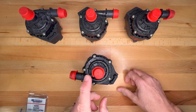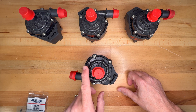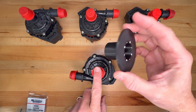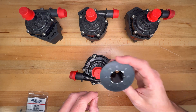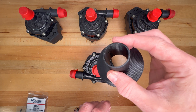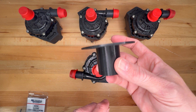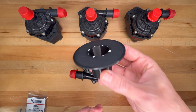Unfortunately inside here are the motor windings and you don't want to get anything on them, so we need to use something to protect them. I have a 3D printed protection sleeve that goes into the center once we remove this end of the pump. I'll give the link for the STL file if you want to print one or have someone with a 3D printer do it — this makes things a whole lot easier.